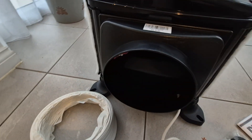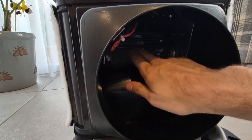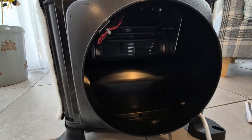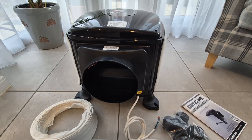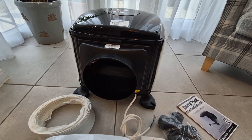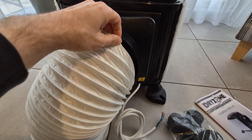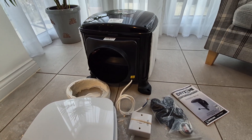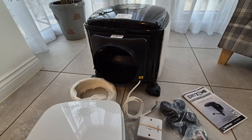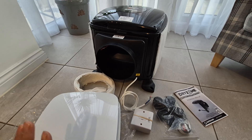The air goes through the filter and comes out here through a fan. There's also a heater element inside, which just takes the chill off the air. Because if the air in the roof space is only a few degrees, it's going to be quite cold. This takes the chill off, so when it pumps air through the ducting into the diffuser, you're not getting freezing cold air going into your house — but you won't be getting hot air either. It's not going to feel warm; it's just taking the chill off.